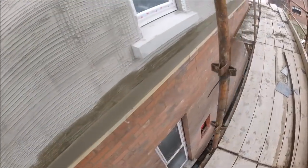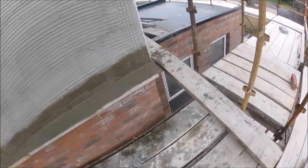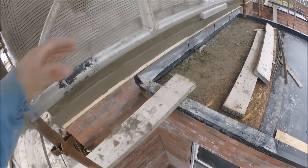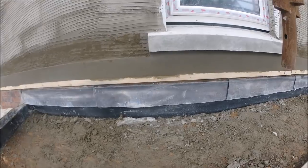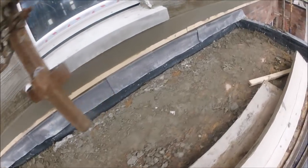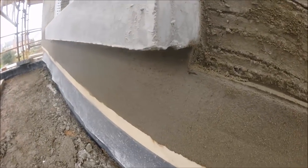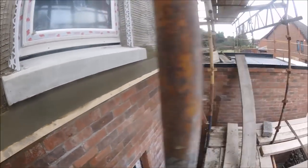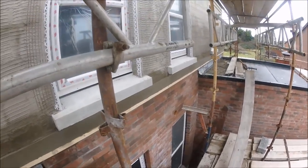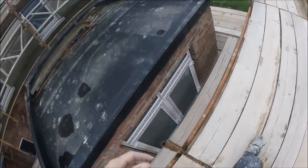This might look like an easy job, but putting bands on is not easy — it's very detailed work, very slow. It's actually more tiring than you'd think. You're up and down ladders, dealing with buckets and tools, and for the cutting you have to hold the level steady — two of us holding it plumb — to make sure that by the time you get to the other end of the building you haven't ended up with only a two-inch bond when it's supposed to be four, five, or six inches. That's the level of detail involved. You can see where we're running off to these sills — this was the best solution rather than having a step at either corner, which would look ridiculous.